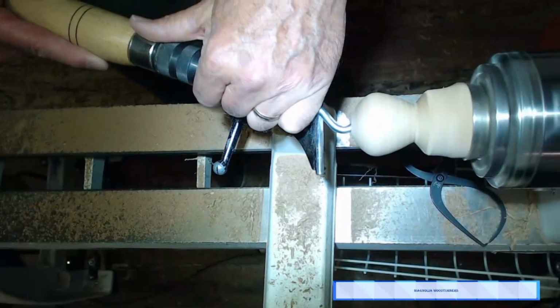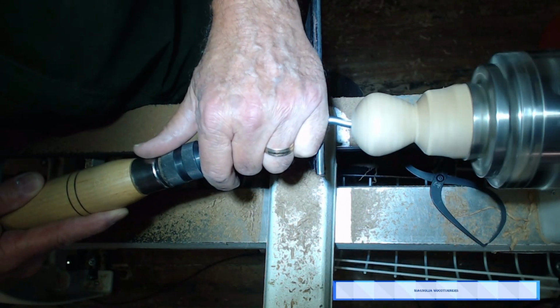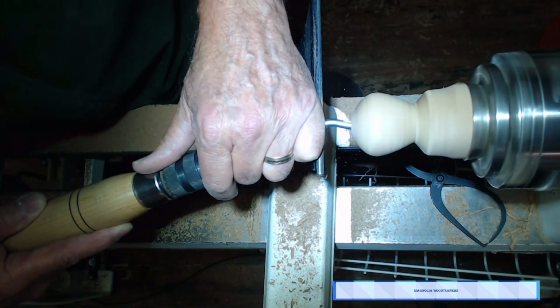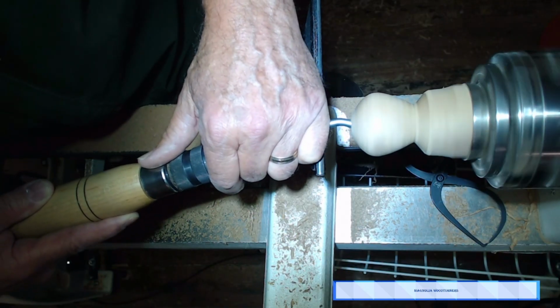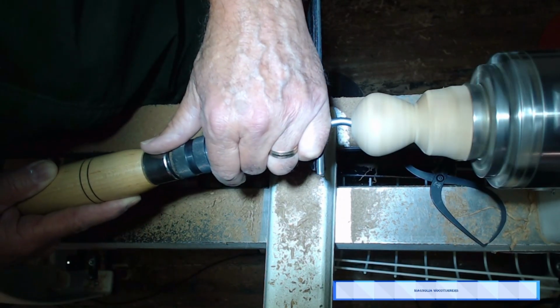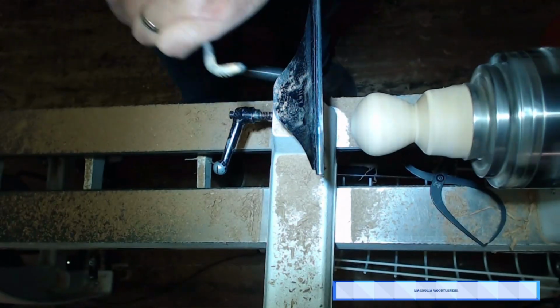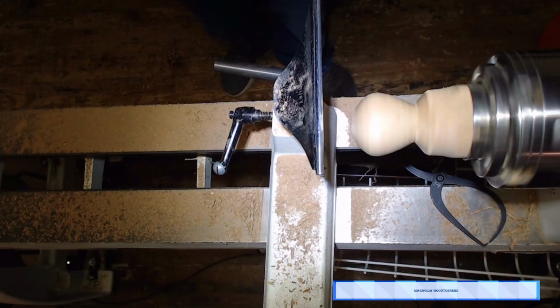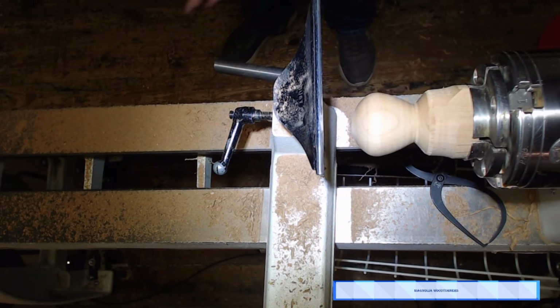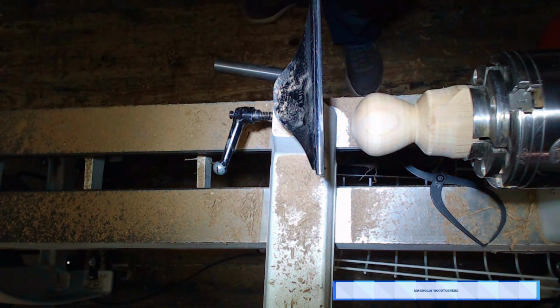But then again, watch when you come in. Curve it around. And I'm just very lightly rubbing it in there. And bring it back out around. Now my lathe at home, I've got a movable switch. I can put it over here and I can just bump it with my leg and turn it off and then pull it out instead of trying to hold the tool and everything.